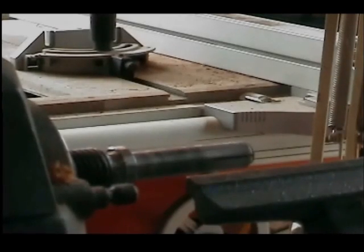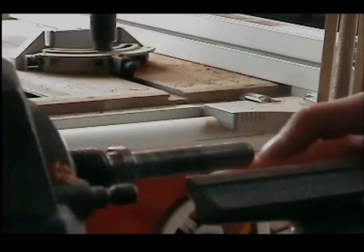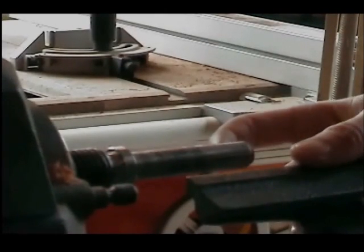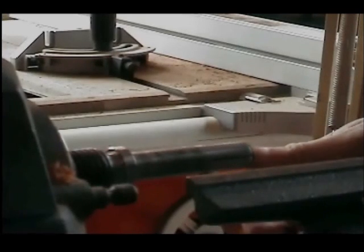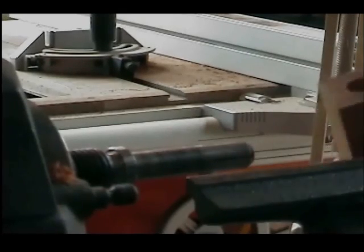Anyways, slide it onto this right here, this expansion mandrel, which I got at Webfoot Custom Calls. He sells a whole bunch of call making stuff. I'll put a link down at the bottom, but it's a hell of a lot nicer than that wooden mandrel that I was using, because I used to turn probably about 6 or 7 inserts to get one that would work and actually fit correctly. But since I got this, I've messed up about 3, and none of them have been due to the mandrel. It's been to me messing them up.